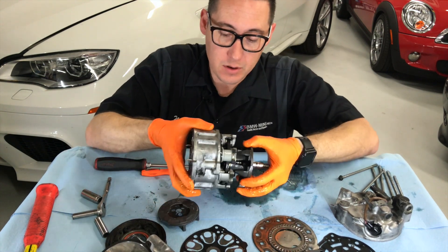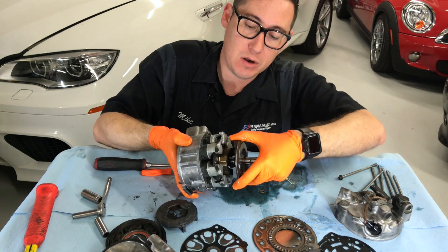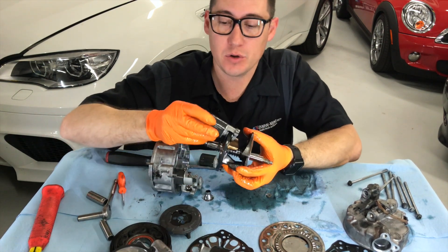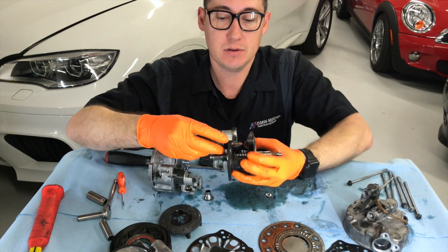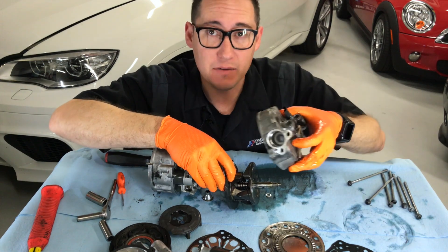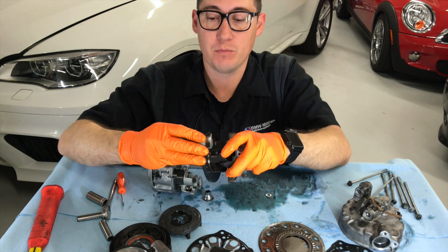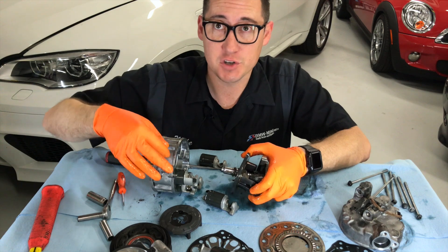Here's the bottom portion of all the pistons. And what this is right here, this little plate that moves along, they call it a swash plate. You can actually see it better out. So here's the piston and it's on the swash plate — the piston rides on here. As this spins, it's not going anywhere because the plate doesn't have a pitch to it. So what this valve does is it changes the internal pressures in here, which then changes the pitch of the plate. So when this spins, it causes the piston to go up and down inside of its chamber.